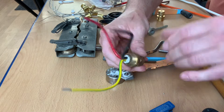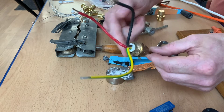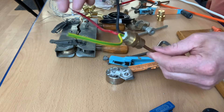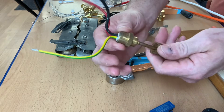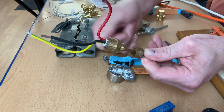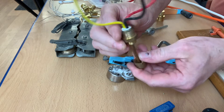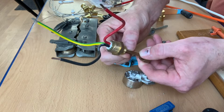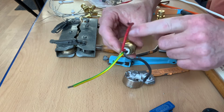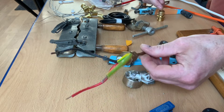This one has a slightly different pot - it's got a CPC. That CPC could be one of the conductors, but it's unlikely because there's so much copper on the outside of mineral insulated cable. So this is actually what we call an earth tail pot. We open this up and see the gland nut. There's a compression olive held into place and squeezed up - when you tighten down the gland nut it crushes the olive, and the gland body crimps against the outer CPC. The two conductors are in old colours - we'd see them now as brown and blue, whereas here they're red and black.